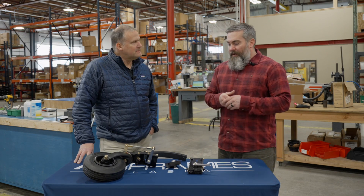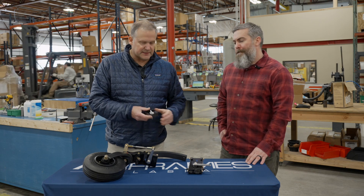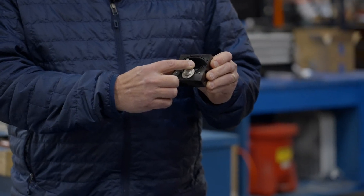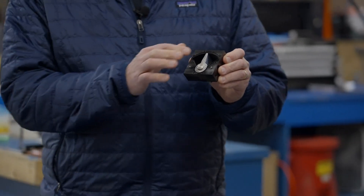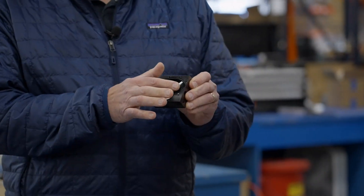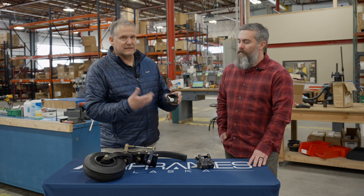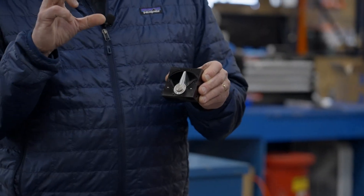Could you give us a little overview of how this actually works? Sure. It's a hydraulic dampener, and this is a cutaway version of the unit. It has a rotary vane that goes back and forth. Basically what we're trying to establish is resistance right at the center point — we don't want resistance as we get off center in either direction. This gap opens up as we get farther away, so it allows less hydraulic resistance. The gap is really thin right there — that's where the resistance is.